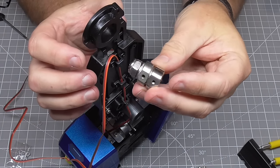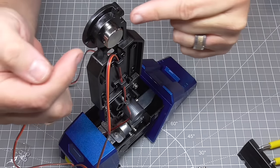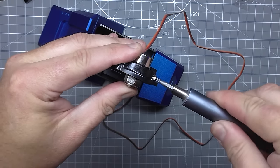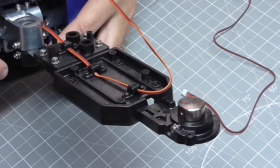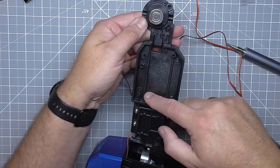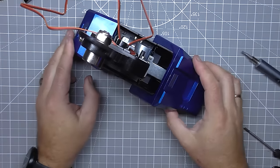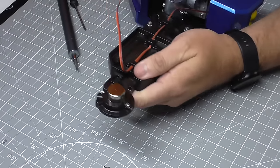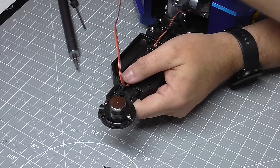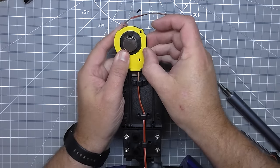Just like we did at the start, we've got one of these joints to put in - it's going to go in this way so there's a hole still seen on this side. I'm going to put this in with the 10mm screws on this side, and I'll put one in the other side as well - that's in perfectly there. I'm going to do the same on the other foot, and this time it's going to be going in this way on this one because it's a different leg - the wires are on the outside of this leg. Over the top of this we have this mount which is going to go and hide this. I need to make sure the wire does go around the outside, so when I put this over the top it's going to clamp that wire into place. That's going to be held in once again with these black 2.3 by 6mm screws.